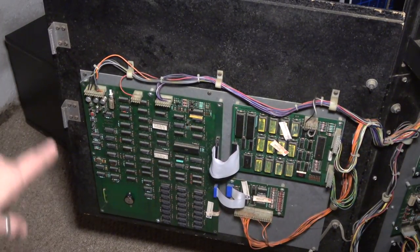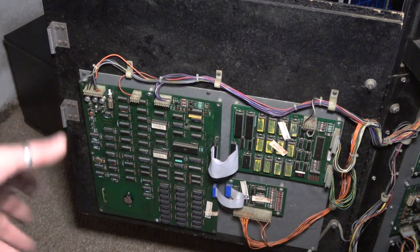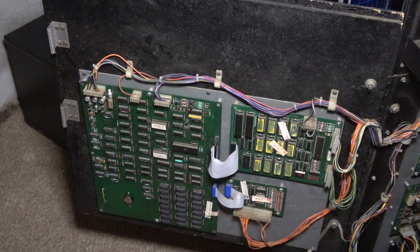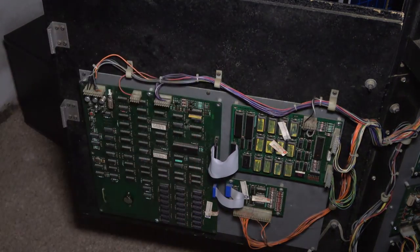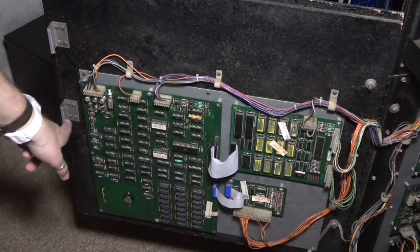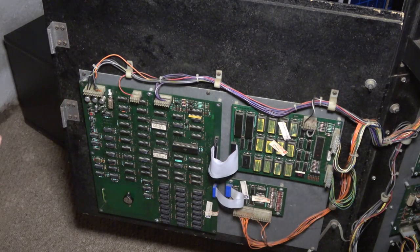He thought that maybe this connector and these headers had a problem, but I said, yeah, but I'm only getting 4.5 at the power supply, so the voltage drop is happening on that side. So I kind of think it's the power supply. But anyway, this is something to look out for too, is replacing all these power connectors on the boards. These can really drop the voltage down.